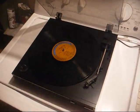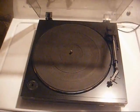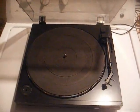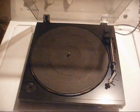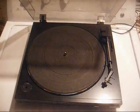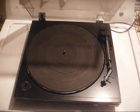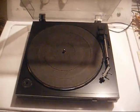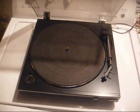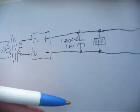Now that that's out of the way, we can do the 78 RPM modification. The simplest way to get 78 RPM would be to simply turn the 45 RPM trimmer up for 78, but in doing so you would lose your 45 RPM. So in order to keep all three speeds, we'll need to add a switch, a potentiometer, and some hookup wire to the existing circuit, and then we will have all 3 speeds available to us.